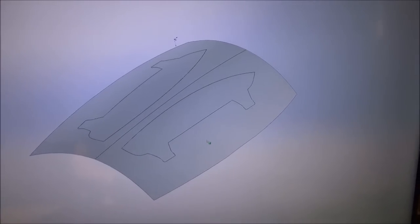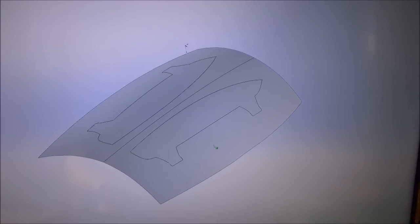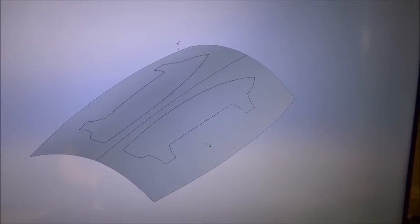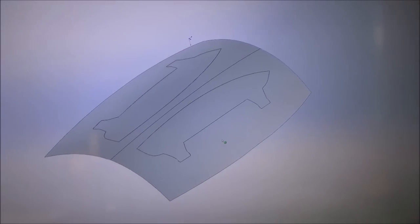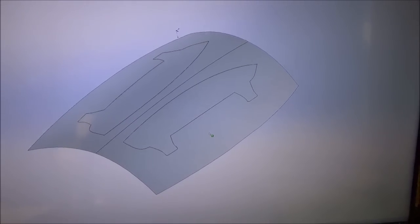Here's that part we've milled — it's curved over with big flanges around the side and has two pieces in it, which are the top outer skins of the doors. When we go to create the mold from this, the mold will be laid over the top, and then we'll be able to lay carbon fiber in that mold and cut those pieces to shape with the right curvature. Today I've been sanding this transition because Jeff molded it all in overnight with epoxy and it was rough.